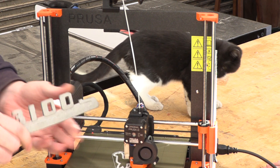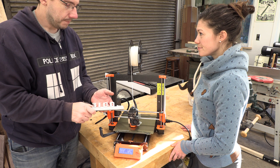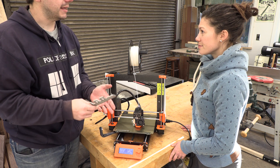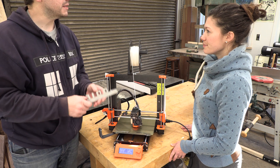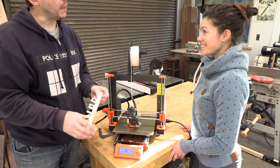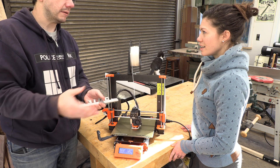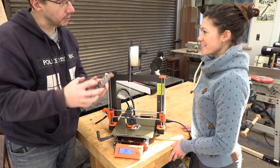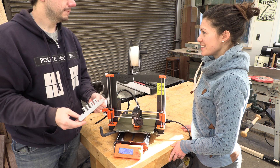When we talk about something like this - this is metal and it would go on the outside of a truck, a really nice truck - if you're going to print it out of plastic, you'd have to use plastics that have enough additives to combat the UV of the sun and to exist outside where temperatures vary a lot. They make plastics that are heat-treatable and you can anneal them in an oven - you bake it for 20 minutes and it realigns the crystalline structure, the same way you'd anneal a blade.